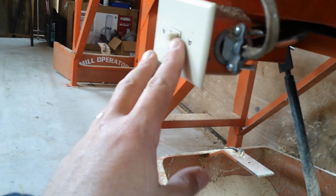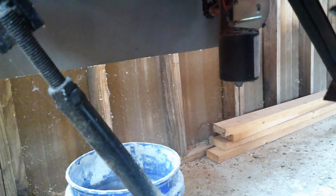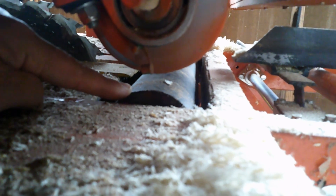The feed rollers are run by this switch right here. I'll go to the other side so you can get an idea — that windshield wiper motor right there is what actually powers the feed rollers. These bottom rollers are the ones that actually force the wood through the blade. It's a 14-inch, quarter-inch-wide industrial ripping blade, which I also got on Amazon. The top roller applies force and the bottom roller actually drives it.